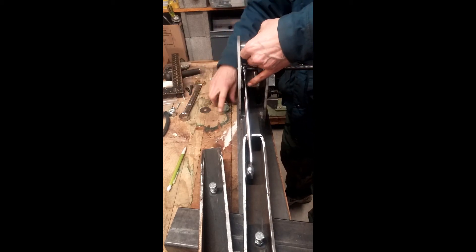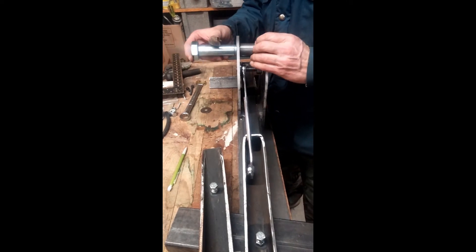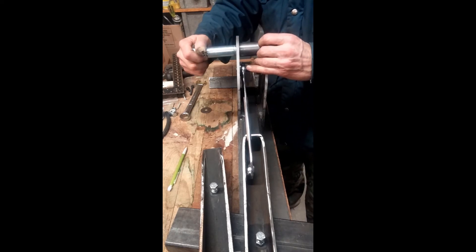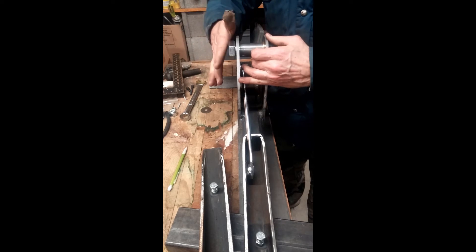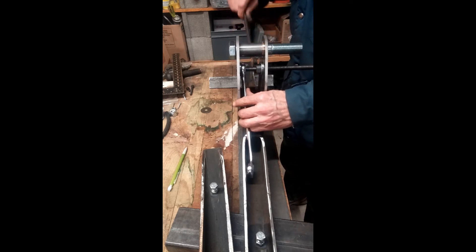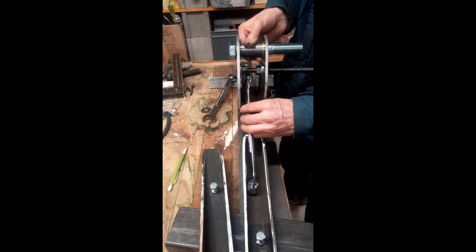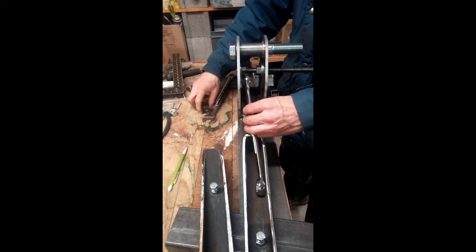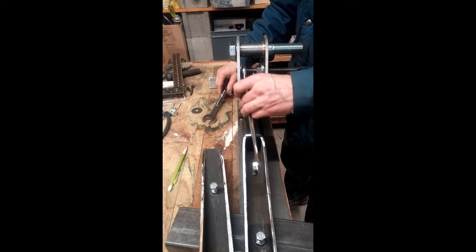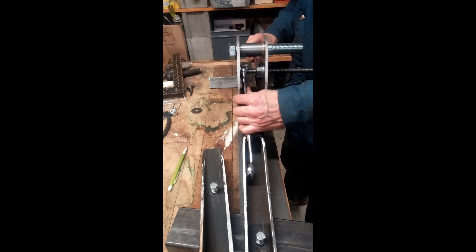Took two flats and we're relieved. I'm going to put the big bolt in, put the two spacers that we need in the final assembly, put that all in, and we're going to relieve the end stress. The open bolt is loose but this is definitely tight — so we've distorted more than our little extra washer allowed. It distorted more than that, so we're going to have to spread this just a little bit more.